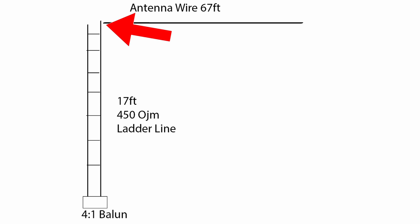The actual radiation pattern would have changed somewhat. We end up with something more like an end-fed ZEP, and I don't think it's really a W3EDP antenna, even though it is claimed to have evolved into what we now see. Nevertheless, it's an interesting antenna: 66 feet of wire is a full wave on 20 meters - a voltage point - and 17 feet down the feeder you come to a low impedance. On 40 meters it's a half wavelength, and 17 feet down gives a medium, fairly easy-to-match impedance. On 80 meters it's a quarter wave, which is current-fed, so low impedance at the feed point, and 17 feet down comes up to a medium impedance. You can quite easily feed that antenna using a 4-to-1 balun.